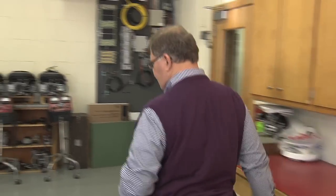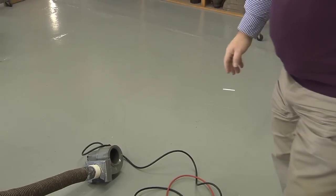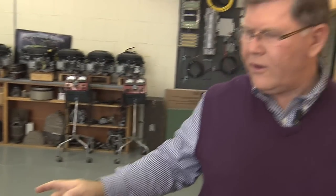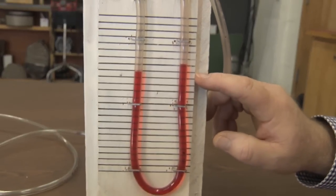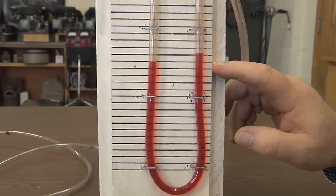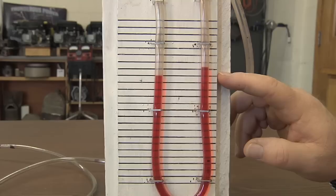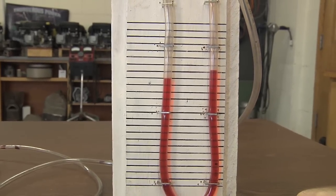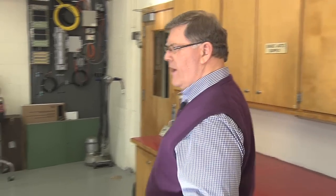Now I'm going to plug the fan in and start the airflow. We can hear the fan running and we've got air going through the bin. What we're measuring is the resistance to airflow through that perforated floor — the amount of static pressure developing under the floor to move the air up through it. As we look at the U-tube manometer, there is one marked difference between those two water levels, indicating that the static pressure going through that floor is a quarter of an inch — the resistance to airflow, or the amount of push the fan needs to develop.